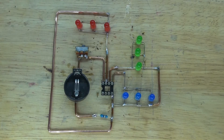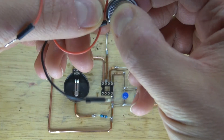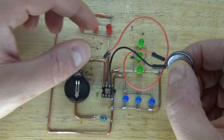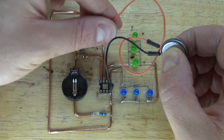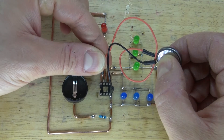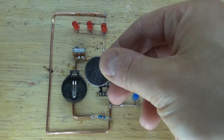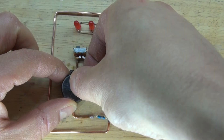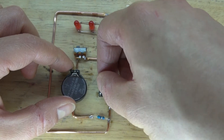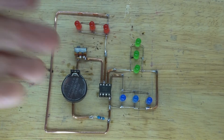The circuit is almost complete. Next, I'm going to take the 3-volt button-cell battery and two jumper wires — one connects to the negative and the other to the positive. I need to connect the negative over to pin 4 and the positive over to pins 5, 6, and 7 to make sure everything works. Touch pin 5 — blue LEDs turn on. Pin 6 — green LEDs. Pin 7 — red LEDs. All of the LEDs work. Now take the 3-volt button-cell battery and put it into the holder. Take the ATtiny85 microcontroller and put it into the IC socket holder. The circuit is now complete and the project is now complete.